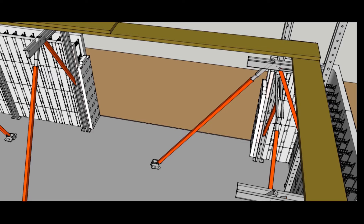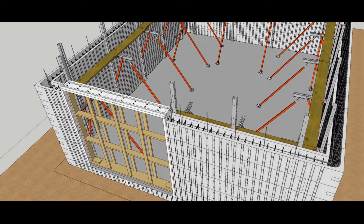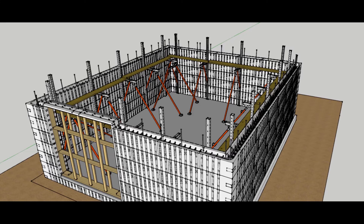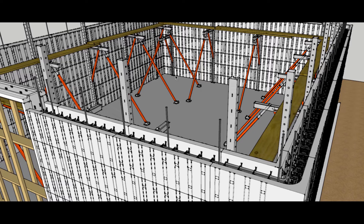At this point we set our door frame rough opening and continue up with our build buck, which allows me to screw in through the brace into the buck to hold everything exactly where I want it. This is six courses, which is eight feet. This is going to be an eight foot door, so we're going one more course. At this height I set my vertical steel — it's a lot easier than trying to manage a nine foot two piece of steel wavering in the air.